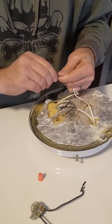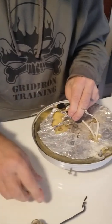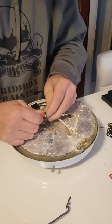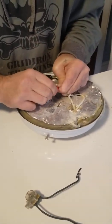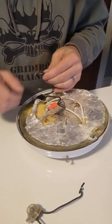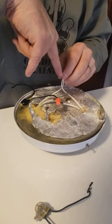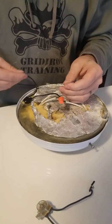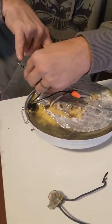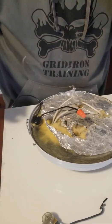We're going to take one lead and then we're going to go back to the black — hot. Wiring up. And then when I get back to the ceiling, we'll go ahead and wire in. This will go back to the white lead coming down from the ceiling and we'll put a cap on that. And then this goes up to the black wire that'll be up there. So we've got white going here, then the black coming out of the ceiling to here — and that's your interrupter. So when you flip the switch, click, it'll stop the electricity. Click it again, it'll allow the flow to continue, and vice versa.